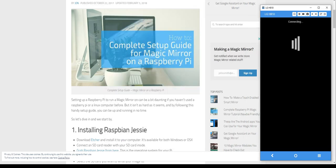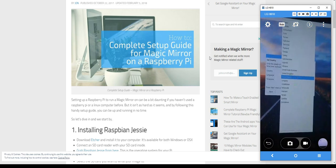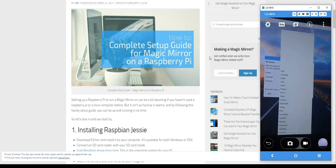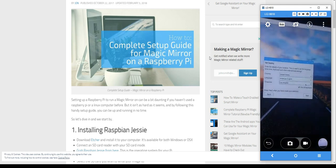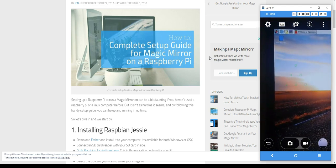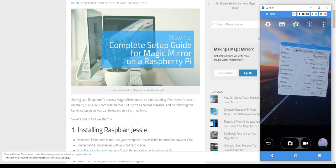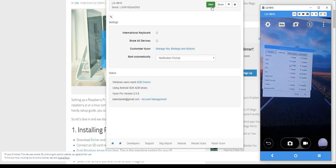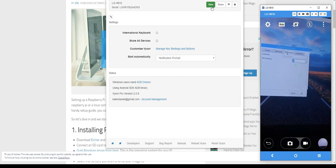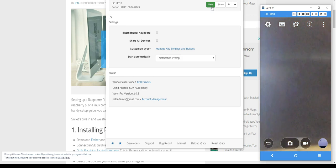This was the best guide I found for setting up the magic mirror. My Raspberry Pi is plugged in via a DVI connector, so I used an HDMI to DVI cable. HDMI to VGA caused all kinds of issues with the screen resolution. When the Pi powered up it had the option to install the OS, and now it's booting for the first time.